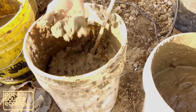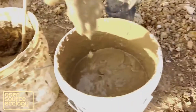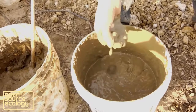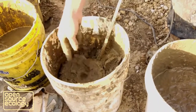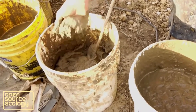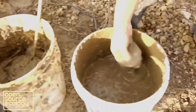See how that sits up on your hand without flowing off? That's more what you want for a plaster sprayer. This consistency you could get by with for troweling. If it's too thick with the plaster sprayer, for some reason this consistency cracks more than if it's thinner.